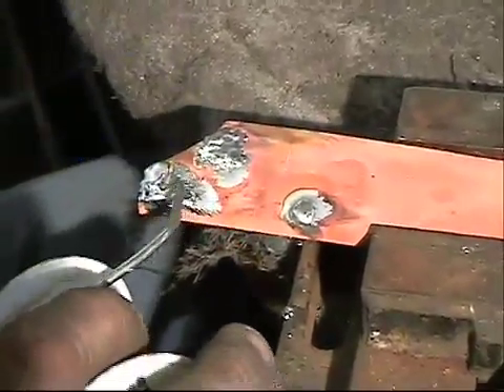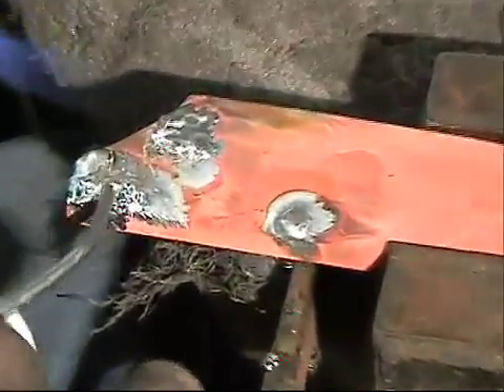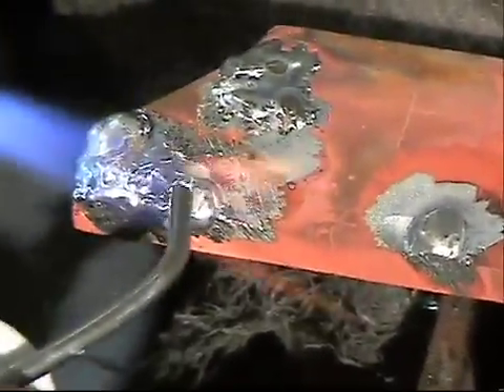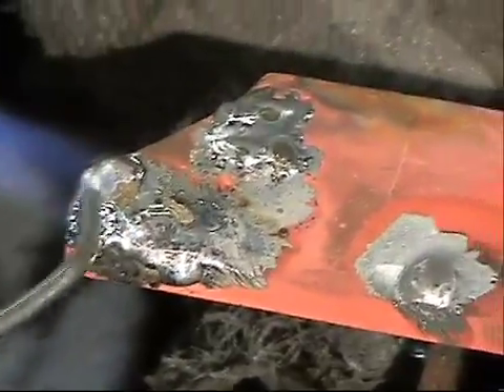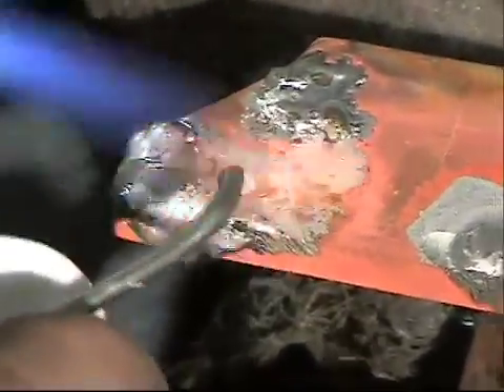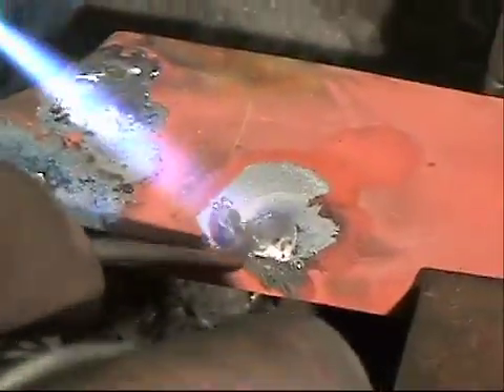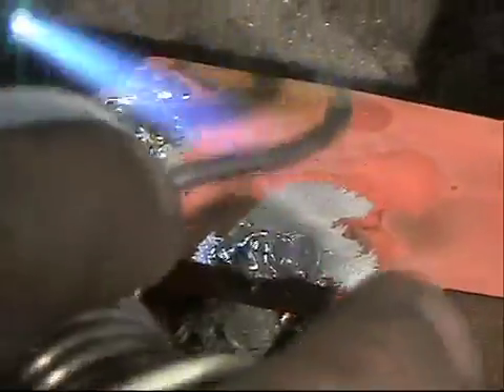You have to watch it with white metal because there's a real thin line between metal and liquid — it will melt really quickly. You have to be pretty dead-on the first time you do this, because you can't go back and start re-soldering once you put acid copper on. The acid copper will blister off and the solder will melt underneath the plating, and you'll be right back to step one, having to take it all down to bare metal again if you have enough metal left.